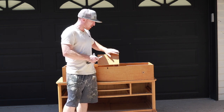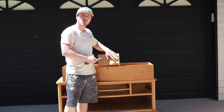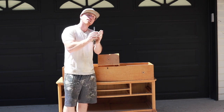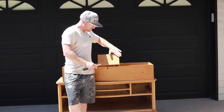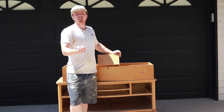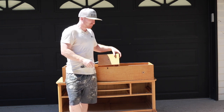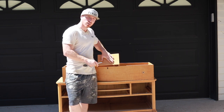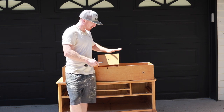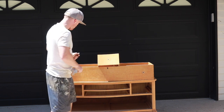We're just going to come out over it, and then we can sand it down and make it smooth at that point. We just want to make sure that we get it far enough out that we can sand it down. If we just try to fill that hole to make it look smooth right off the bat, you could have a little bit of an indentation, things like that. It's just easier, if you have sandpaper, to put more on there, let it dry, and then sand it smooth and create the perfect lines that you need. So that's what we're going to do today.